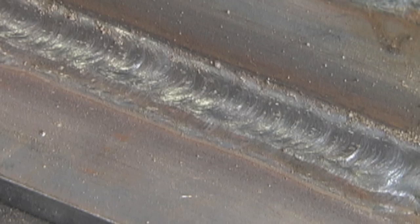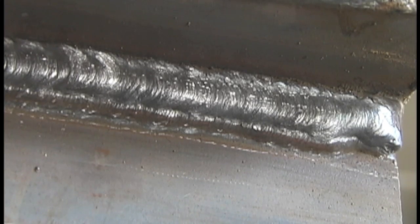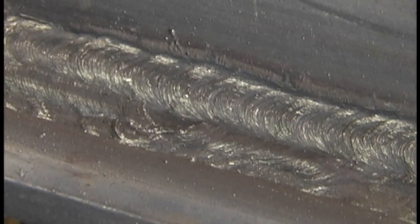I've got it laid down flat while I'm brushing, chipping, and grinding it. For the final pass on any multi-pass fillet weld, it tends to go slower — you have to hang around a little because you're filling in a nook. Always watch the top really carefully, try not to bobble and leave undercut, and go just slow enough to avoid undercut. If you don't stack them just right, you may need to go a little slower to make it even. That's a layer of three passes, total of six beads now with the 3/32" rod.